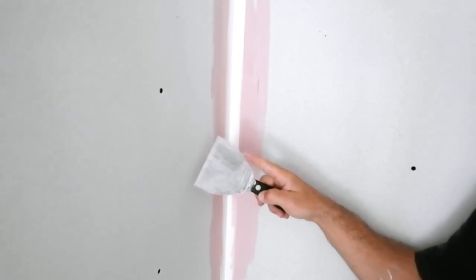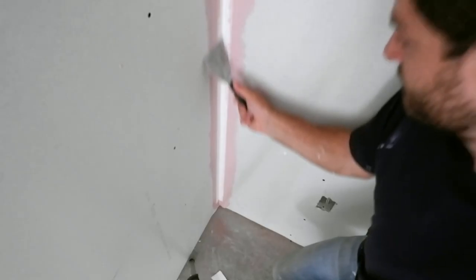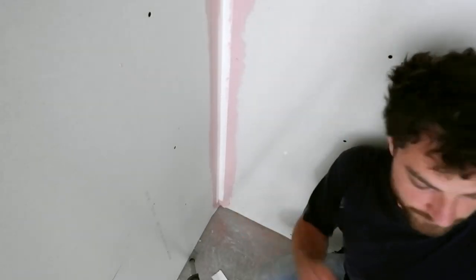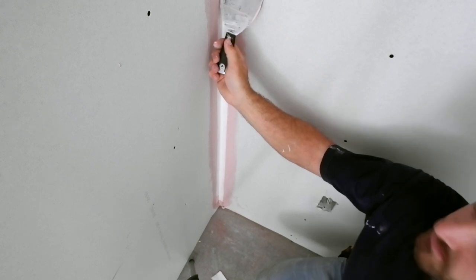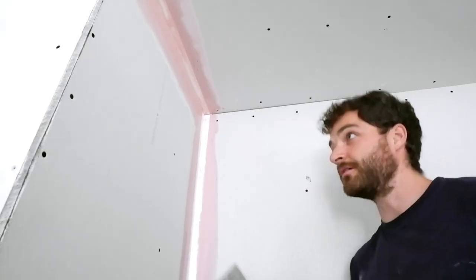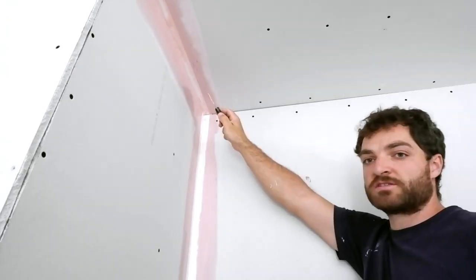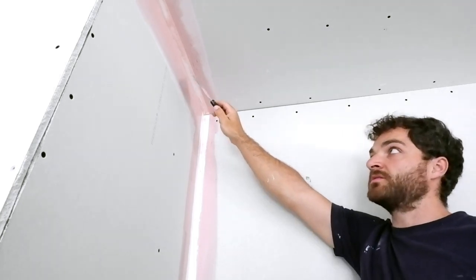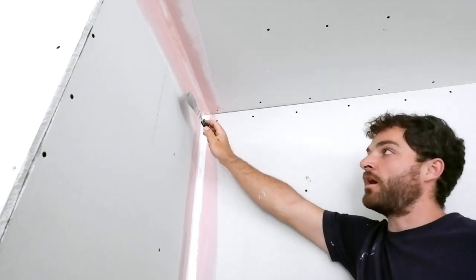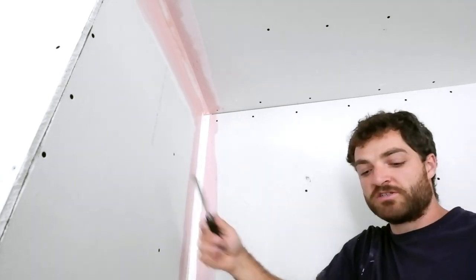Go tight, riding this edge against this side of the wall, pull it tight. And then again on this side, do the same thing. This is what's called a three-way corner — they're definitely a little tricky. Just take your time if you are learning or a beginner. This corner is completely done. I have the one side mudded, now I'm going to do the opposite side of the wall to do my second pass on this tape I just laid. It's important you do the opposite side.